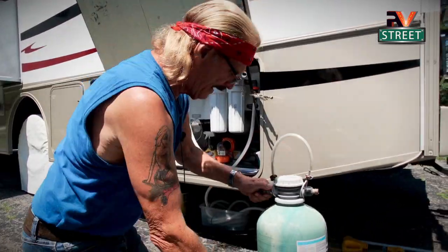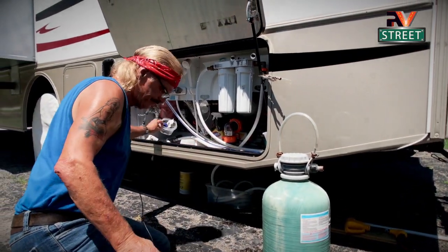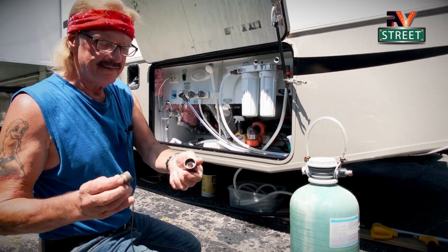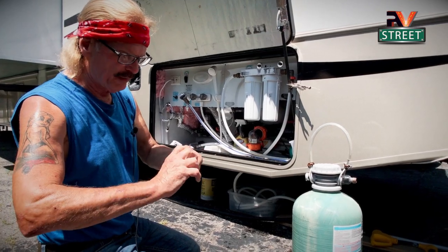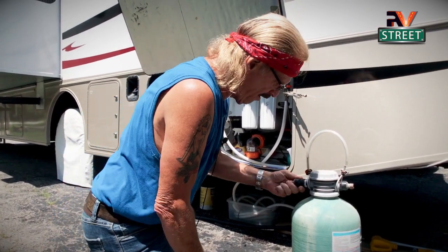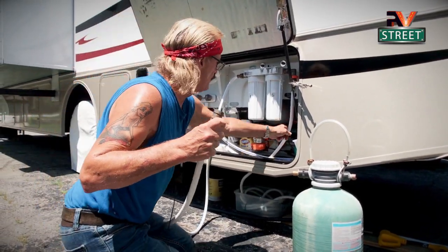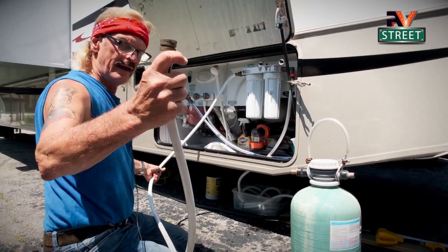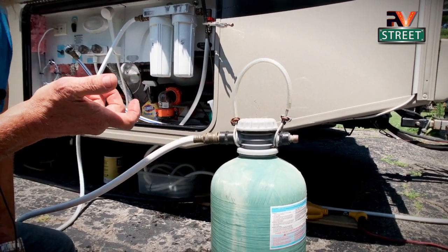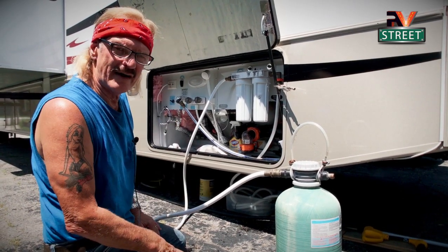So I'm going to take my channel locks, which I carry with me in the wet bay all the time — I keep an extra pair right here — and I take this quick disconnect off. When you buy the on-the-go water softener, it comes with an adapter. I've put another quick disconnect on the adapter. This is what you normally get, but to make things easy I just put my quick disconnect on there. It stays here in my little bowl of parts that I use all the time. Now I put this connector on here, give it a little snug, and then I take my water line — the one that comes up here, through here, through here, and out. And this is when I turn the water back on — it's going to come through here, into the water softener. Now I'm going to go turn the water back on at full stream and let it shoot out here for about seven minutes. They recommend five to ten — I'm going to let it go seven or eight.